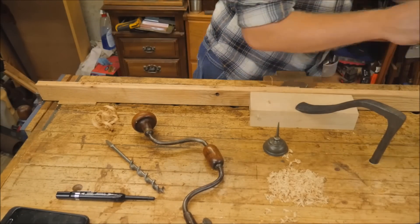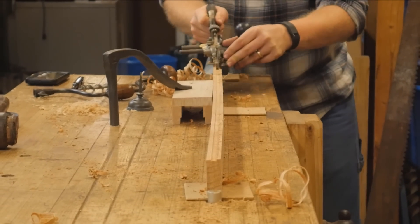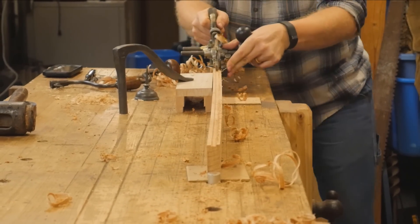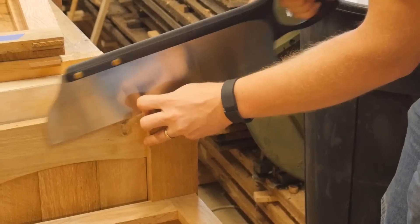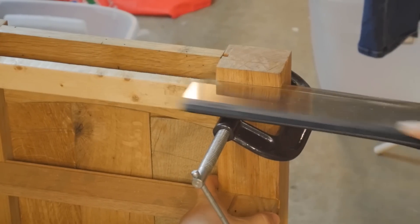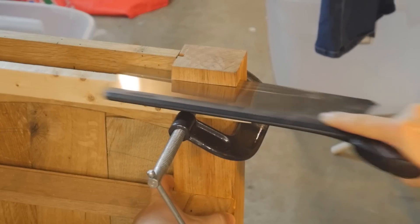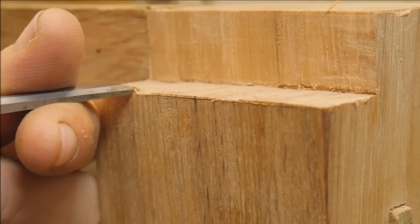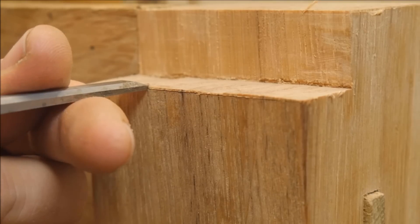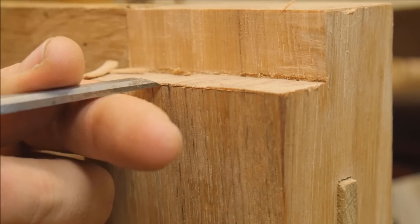After that, the two long pieces — the rails — need to have a groove cut in them end-to-end. I set this up on the bench so I could run my #45 plane all the way along. I love making grooves in wood. Once these grooves have been made, I can make the notches in the top of the legs of the dresser to recess into. I put a guide on there for the saw to rest against, which allows me to cut this rabbet dado out of the end. With the rough sawn work of the saw done, I can come in with a chisel and clean it up. Having a really sharp, clean chisel is one of life's pleasures.